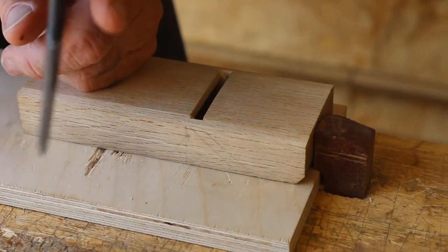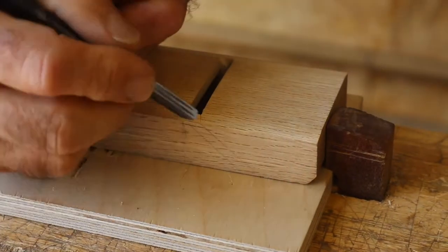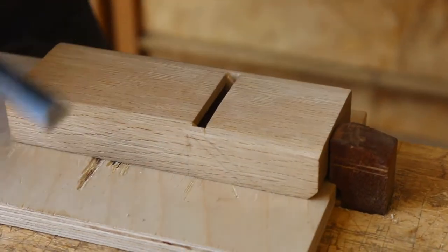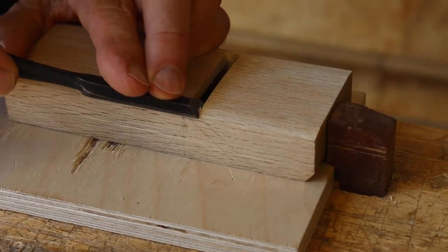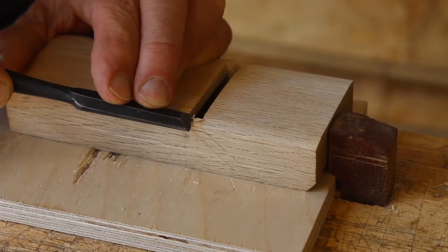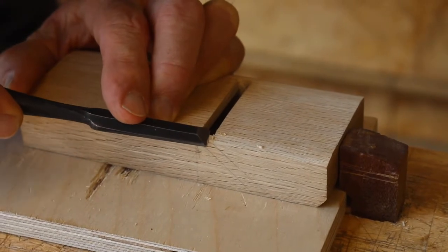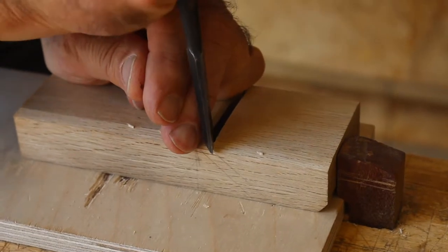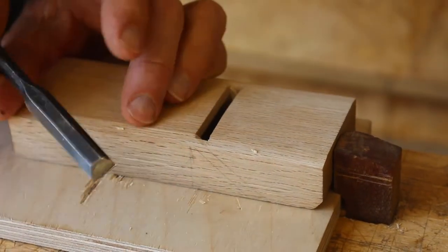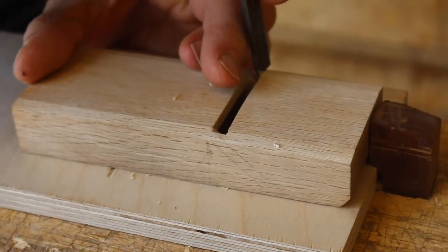This is called Mimi in Japanese, which means ear. These are angled back five or ten degrees. The cut goes down vertically and also parallel to the surface — straight down until you reach that chamfer that we've set in there, and then gently relieve that cut. Let's not get too ambitious; if you overdo it you're going to crash into the wood and liable to split some out. You want to get just down to about there — from this point to where you've done that point there. Do the same on the other side.